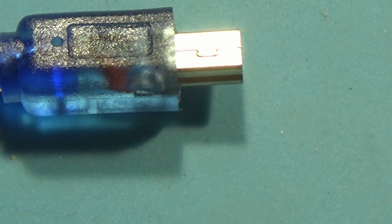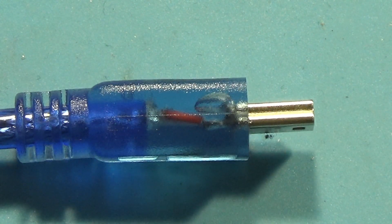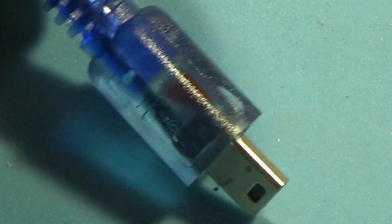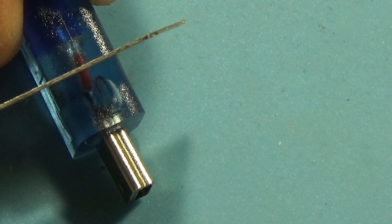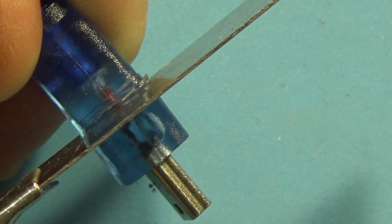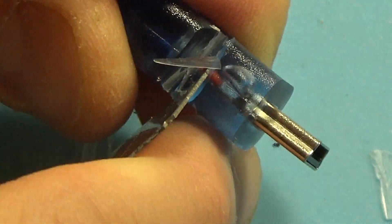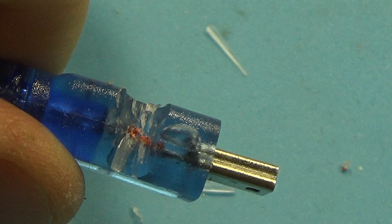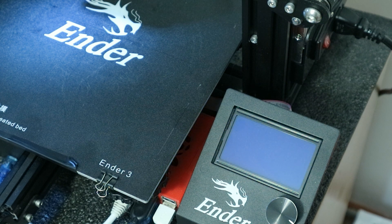I use a mini USB cable with my Ender 3 that is partially transparent, so I can see the individual wires inside. The USB wiring specification tells me that the red wire is responsible for providing the 5V to the printer. By cutting that, the problem should be solved. Of course, be careful not to cut wires other than the red one. You will end up with something like this — you can fill the gap with hot glue, electrical tape, or anything you like. Now let's see the prepared cable in action. Boom! Power gone!